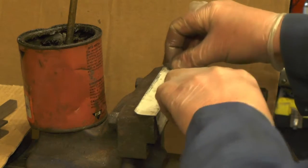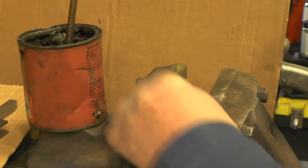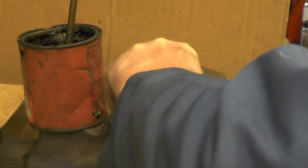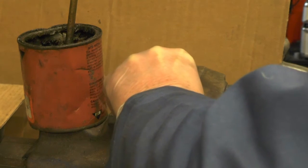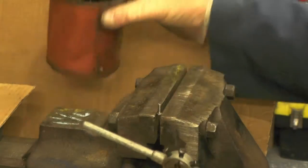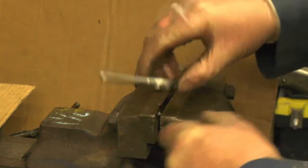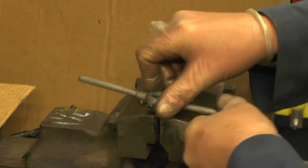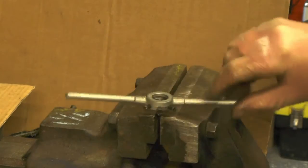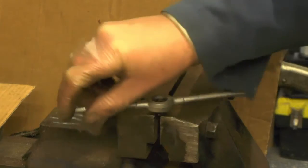So I've saved one of the screws to demonstrate — I've done all the others, just got this last one to do. I'll put this in the vice and show you that if you've got a 6BA die, it'll just run down this M3 thread, a nice fit. Put a bit of compound on and it'll give a good thread. There's a little bit of force — it's probably just changing the thread form.